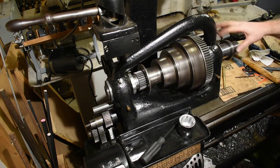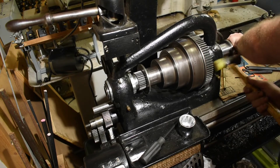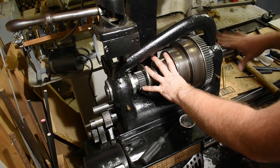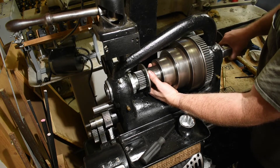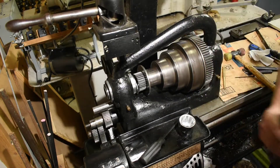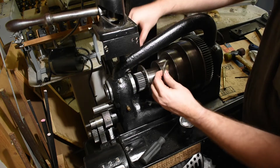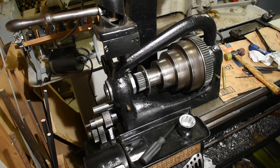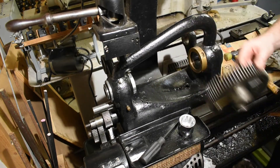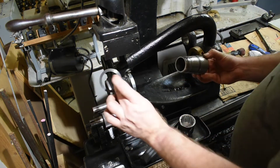As you can see we've made good progress and most of the spindle will start to come out. Now that this is loose, all this will slide this way and we can keep on tapping this bull gear — he's mostly loose. This weight will kind of trap the spindle in here, so you want to reach up in here and lift up and wiggle it back and forth, and then it will start to come out. Now we have the spindle. Now we've got to collect all the extra pieces — there's a spacer in here, there's a lock collar, there's the cone head, and then the bull gear. The last thing we need to do is push out this bearing piece.